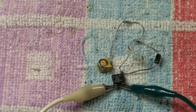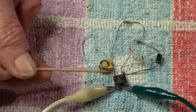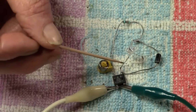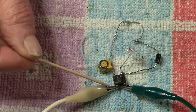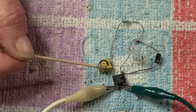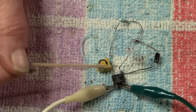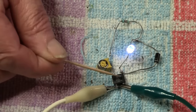And so, just to show you how simple this is and how easily it works correctly, let me show you. There's the bridge rectifier, what we've just discussed. The negative of it is here, which is on the negative end of the LED. There. The positive is on the positive end of the LED there, from the output there. And that means what we've done is literally that crocodile clip was originally clipped onto this leg here, and that crocodile clip was originally clipped onto this here, which means we just put the bridge rectifier in between. Now watch, here's forward on the controller. Yeah, we got the LED. Now backwards on the controller, and we've still got the LED. And it's this baby that's going to do that for you.